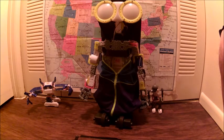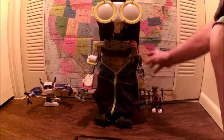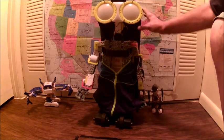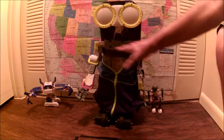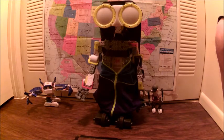My Mechanoid does not have the servos configured exactly like a KS. For instance, on this arm I have a hand gripper — there is no hand gripper on the KS — but it is three servos. This arm has the added servo, so it's not configured like a KS. But with three servos on each arm and two on the head, you're actually faking out the firmware and telling it that you have a KS model. The firmware only looks for the number of servos — three on each arm and two on the head — not how they're configured. And when you power it up, you won't hear those error messages.